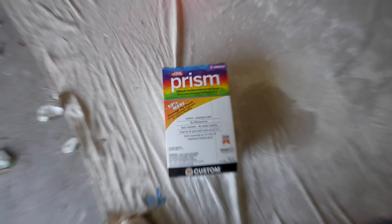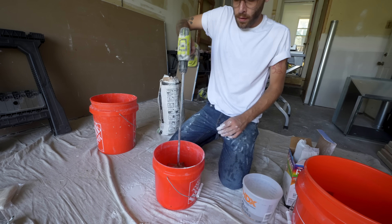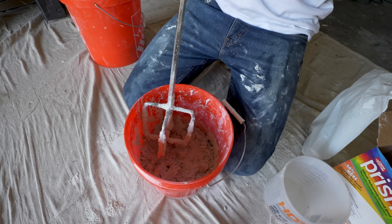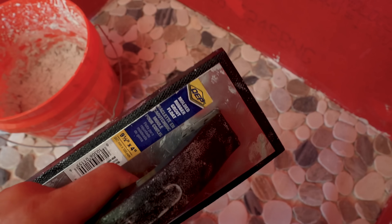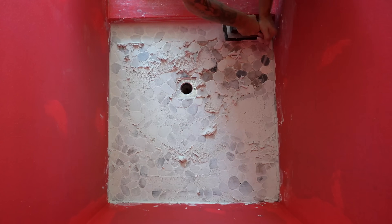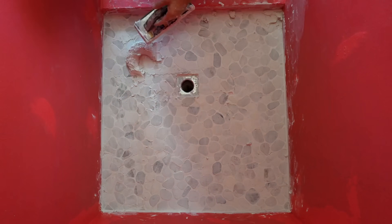Now let's finish up this shower floor — it is time for grout. I'm using a product called Prism because it's good for tile butt joints all the way up to a half inch. I'll mix this up and give it five minutes, kind of like I did the thin-set earlier. You can get unsanded grout but typically that's for small joints up to an eighth of an inch, so you'll notice any other grout is pretty sandy like this. You spread everything with a grout float — it's basically a thick rubber foam material with a trowel handle — and this pushes the material into all the cracks around your tile and squeegees the face of the tile to get it cleaned. The important thing is to work the grout float in every direction to get it pushed into those grout lines.